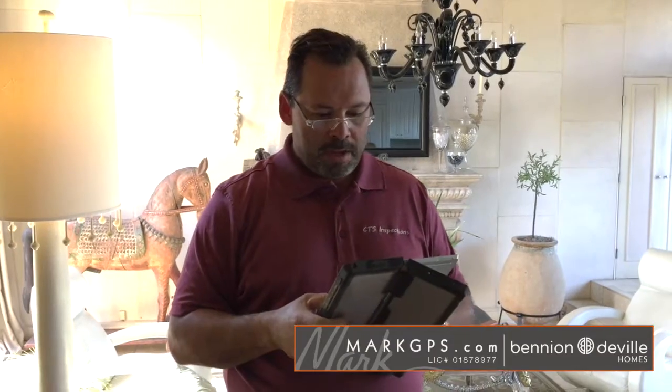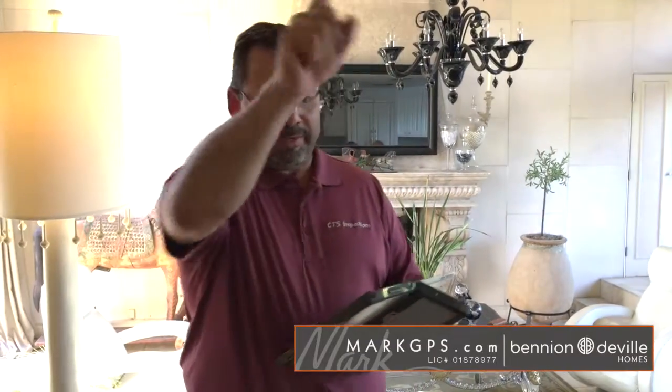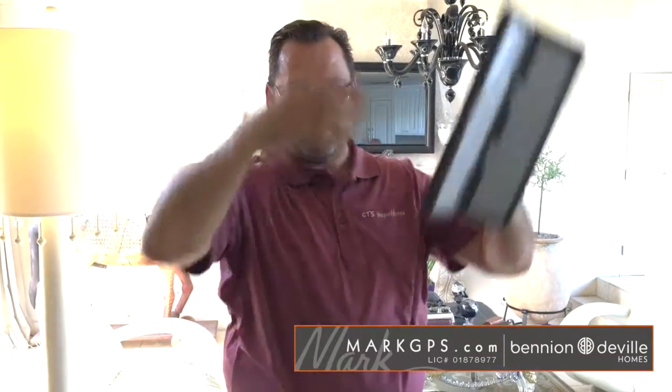The vent pipe to the heater that's in the garage and the water heater, they share the same vent pipe as they exit the roof. Should we go take a look at that? It's on the roof. The vent pipe should be at least 24 inches above the roof surface, and it's flat up against it, so it needs an extension to be code compliant.